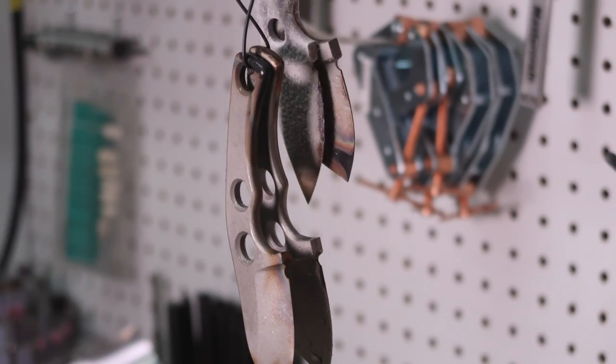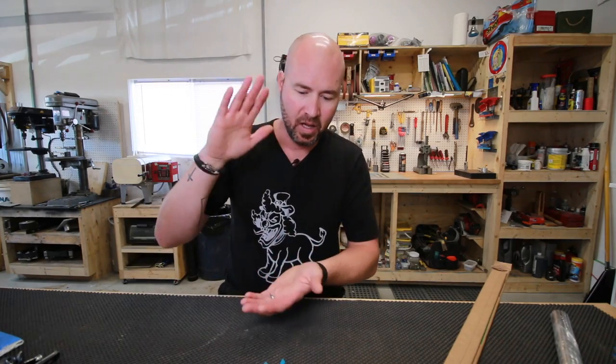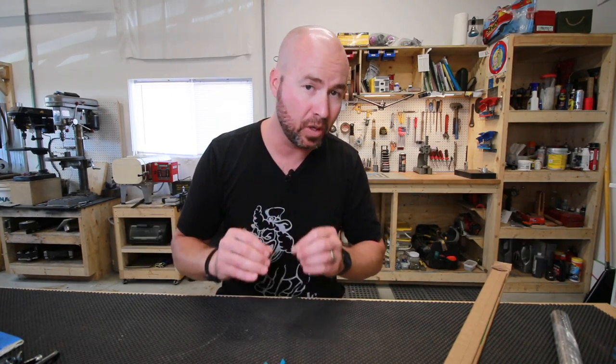So that's the Dewar, that's my liquid nitrogen. Typically what I will do is I'll plate quench. So we've gone through the hardening, we've quenched it, and now that blade is super, super hard. Usually, with a CPM 154, I will go straight into the liquid nitrogen once it's cooled to room temperature. I usually let it sit for about an hour and cool off a bit. Then I'll leave it in liquid nitrogen.